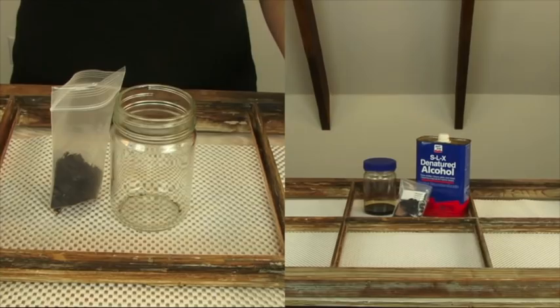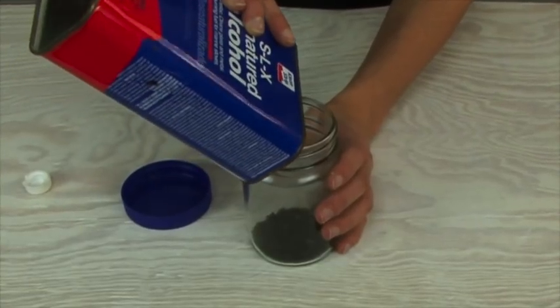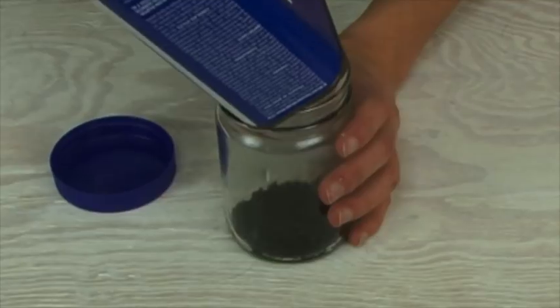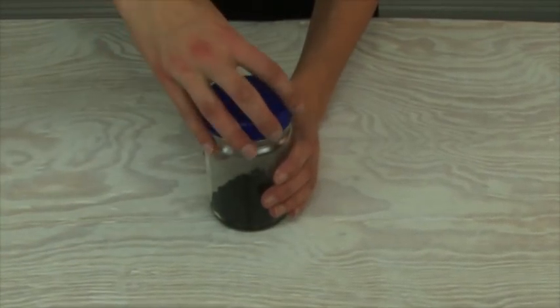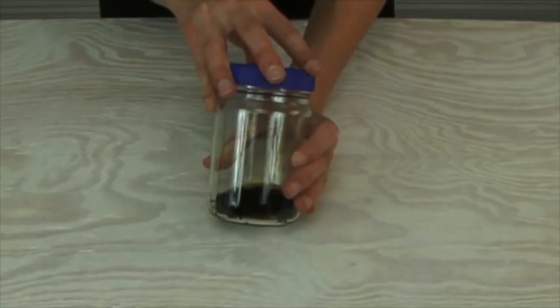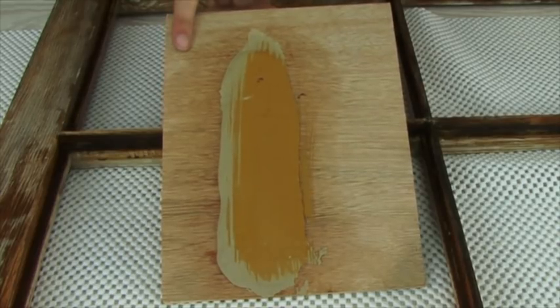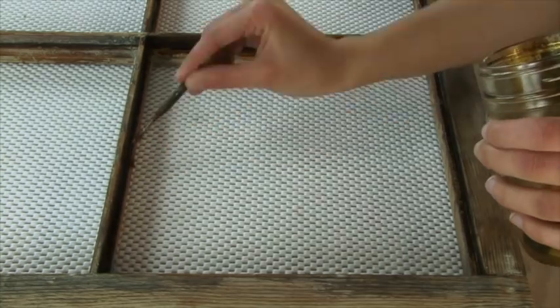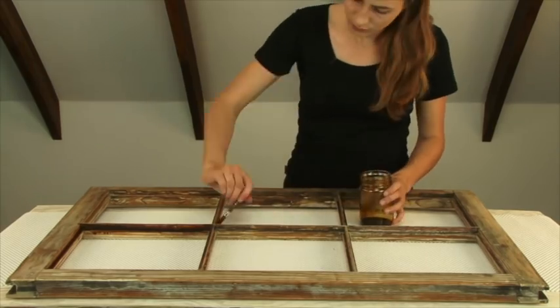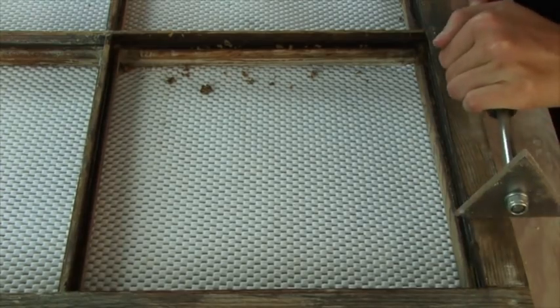This is one of the most important steps of the process, and the only time we use a little bit of solvents. You will need shellac flakes, denatured alcohol, and a glass container to mix in. Fill the container with just enough denatured alcohol to reach the top of the shellac flakes. Let the flakes dissolve in the liquid overnight — in the morning you will have a syrupy shellac mixture. If it dries out, just add a few more drops of denatured alcohol. Without a shellac barrier, the raw linseed oil will soak into the wood, drying out the putty prematurely. Apply a thick, even coat of shellac onto the glazing grooves — this will dry within a few hours. It is best to shave or trim away any excess shellac from the wood surface for an even paint job later.